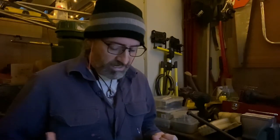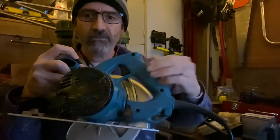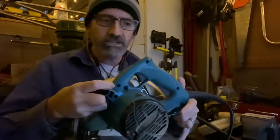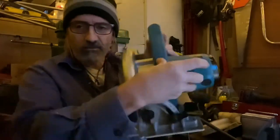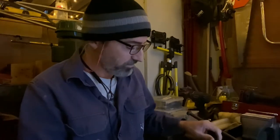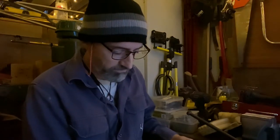The depth adjustment lever has been beautiful — being able to just flip that up and down and lock it in place. I can sit it on the edge of a piece of timber, loosen that up, raise and lower the blade so that I'm just cutting through the bottom of the timber, lock it, and it's been brilliant. The balance once you've got it up on weird angles is great. I did some cutting of melamine coated chipboard for shelves and the first cut I rushed through and got chip-out on top, but when I set it to just over the thickness of the board and took it slow I got a clean cut on both the underside and top. So setting the blade height correctly is going to help a lot with that.